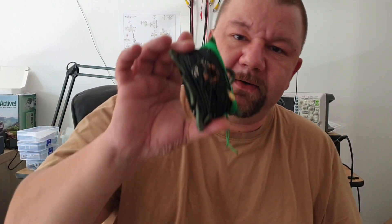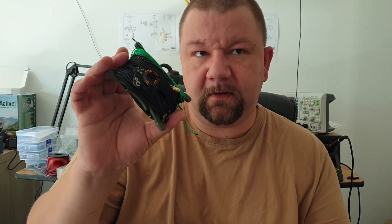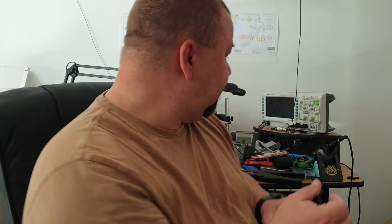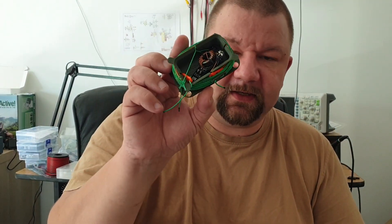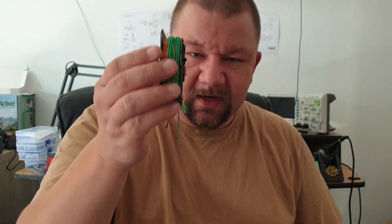I also played a little bit around with my portable antenna. This is a basic EFHW for 40 meters, also 20, 15, 10. It's basically the same antenna I have here. This is the pocket antenna — you probably remember my last videos where I did portable operations. But this has copper enameled wire. It's super light, portable, compact. However, this copper enameled wire doesn't last long. That's the problem. You can build this antenna up five to maybe ten times, and then it starts to show some wear and tear.